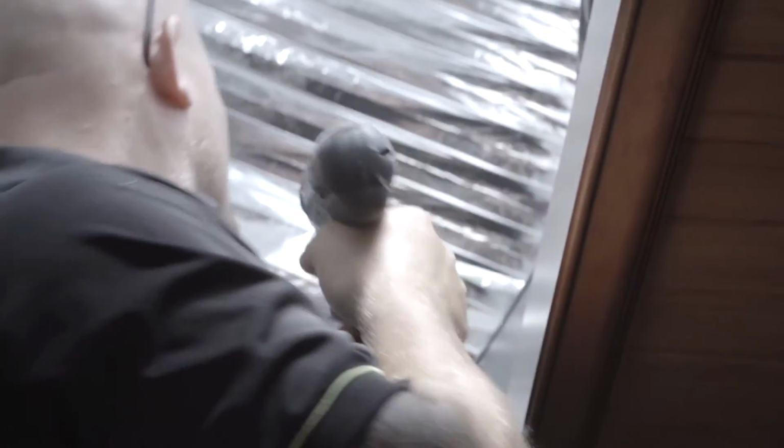What we're going to do today is the same thing. We're going to change this to a SkyTunnel roof part up on the roof with a tubular flexi tube down to a highly reflective conversion box which sits about 300mm above the ceiling frame in the ceiling, and we're going to show you exactly what the difference in the lux achieved via the SkyTunnel system.